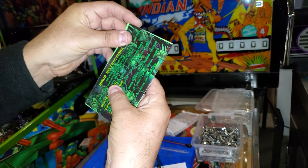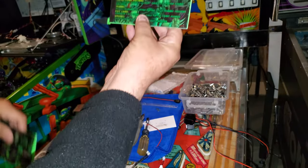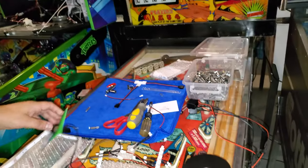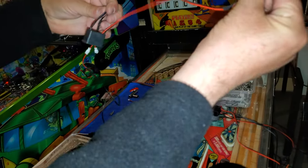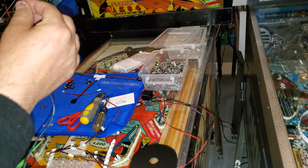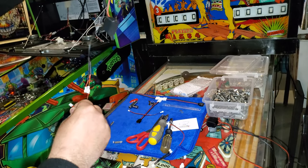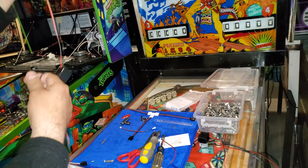And then I just put a little piece of tape underneath it just to keep it in place. You're not really going to see it when it turns on anyways. Again, this uses the same transformers, and it's all 6.3 volts, and it's all wired to the matrix connector. So it is plug and play. This will plug into the other plug here, and then that's your circuit out, and this is where your power is going to come onto this end, and it's very simple.